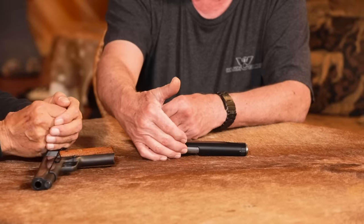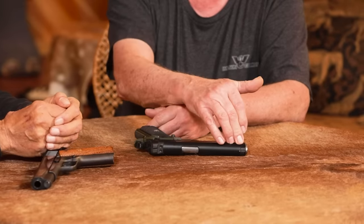When you look at how much you invest in the gun for the performance, how do we get from ordinary 1911 accuracy to one-inch-at-25-yards accuracy and still keep that legendary reliability? The most important thing is bore quality — you've got to have a barrel with a very high quality bore. Then you've got to get the barrel to lock up the same every time the gun closes. It's nice to have a tight slide-to-frame fit, but that contributes very minimally to handheld accuracy. As long as your barrel locks up well at the top, bottom, and bushing, you're going to get good accuracy.